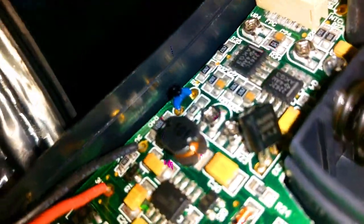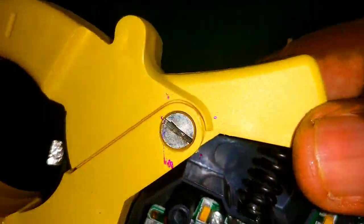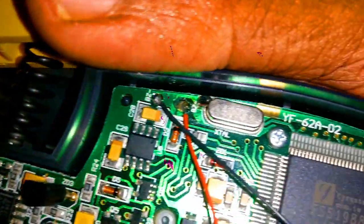But why is it soldered like that? The soldering is very bad — it looks like very fast, careless soldering. Why did it fall down like that? I don't know. Looking further at the board, there are several other bad solder joints visible here as well.